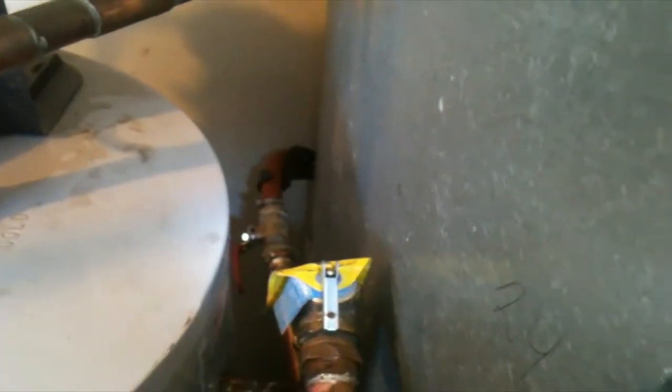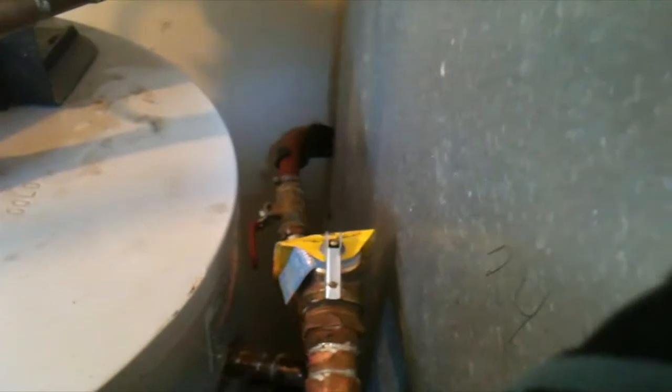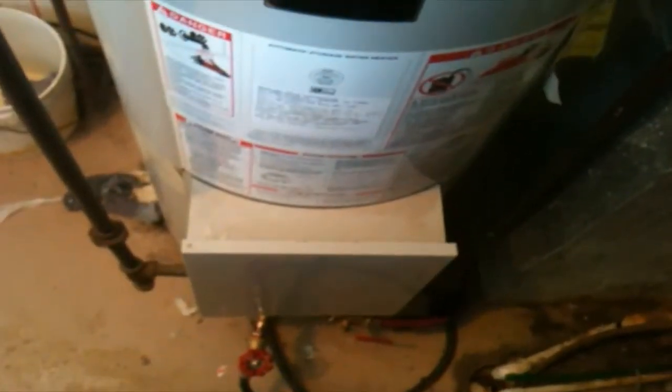Okay, and now this cord runs down. I've got a 3-speed pump, and that runs behind the furnace. Okay, from the cold water, or cool water I should say, out of the hot water heater, and the hot water return, after it comes out of the copper coil in the potbelly stove, comes into the top of the hot water heater, and the thermodynamic nature of hot water forces the cold water down towards the bottom, so you're constantly getting a cooler water flow from the bottom into the boiler, and out of the top you get your hot water.